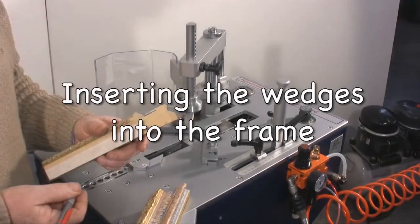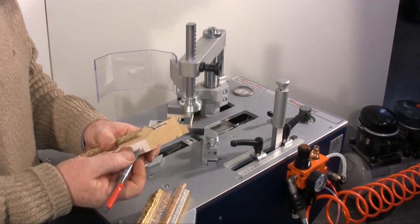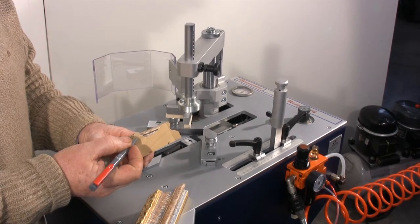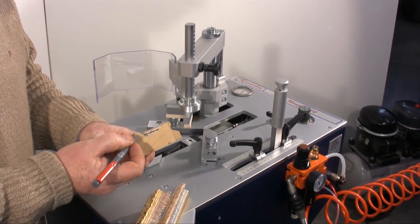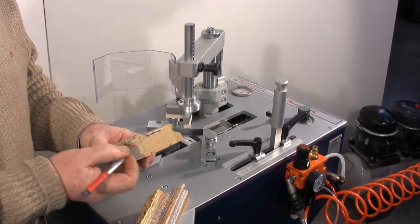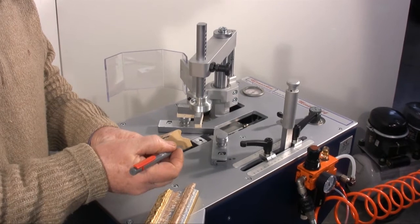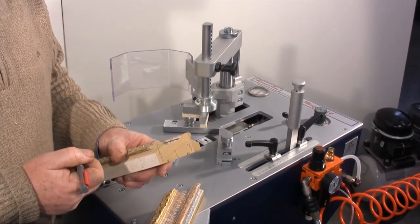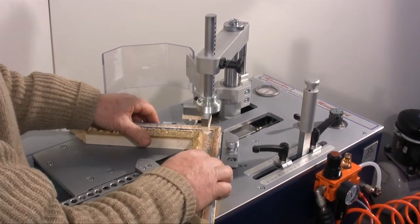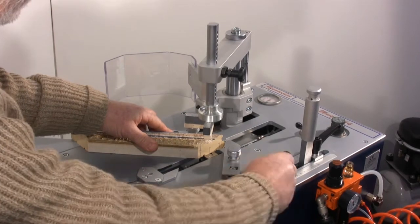You can use the magnet which is provided to remove the wedges which are found inside the underpinner. We now analyse in detail the phase in which the wedges are inserted into the frame. To show how the wedges are inserted better we mark the position of where we want them to go. On the top part of the frame two 15mm wedges are to be stacked. Another wedge in the middle of the frame and another towards the outer part of the frame. Then according to the positions which we've drawn on the frame we fix the position of where the first wedge comes out.